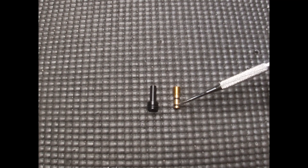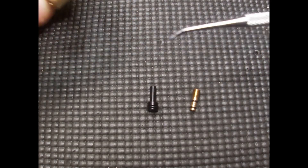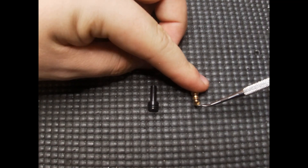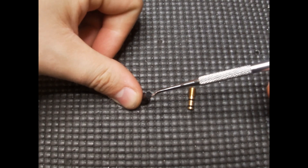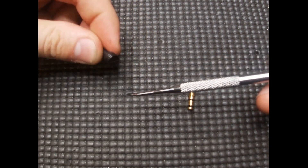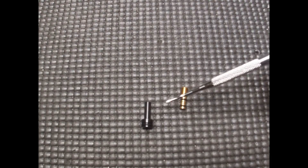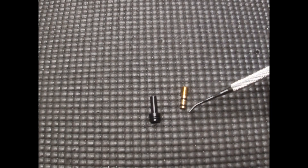The first location is the lower o-ring on the regulator screw. There is an extremely small hole in the regulator screw directly above the lower o-ring, which accepts air from a slightly larger hole in the side of the regulator housing. This air is supplied directly from the bottom, then passes through the small hole and pressurizes against the piston. The regulated air then passes through a small hole in the top of the regulator piston and out the bottom into the valve assembly. If air leaks past the lower regulator screw o-ring, it causes excess supply air to press against the piston, increasing regulator pressure — most often resulting in regulator pressure matching tank pressure.